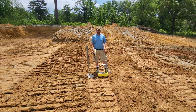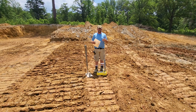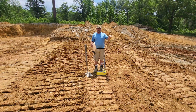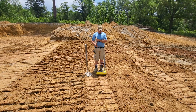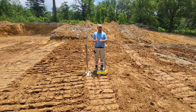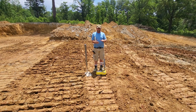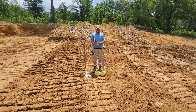What I have in front of me right here is called a nuclear gauge. I've got an outside firm coming in here that's actually checking us and checking each layer of soil — the clay that we put in here — making sure that we're meeting the compaction we need to have for a dam this large. We put our lifts in at six to eight inches and then we use this nuclear gauge; this outside company is doing it for me.